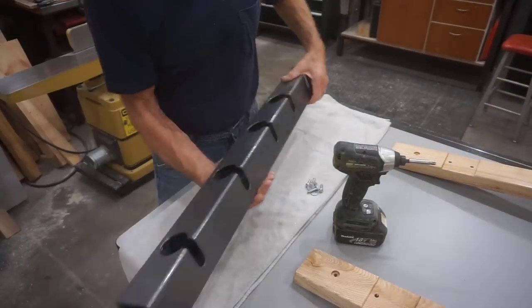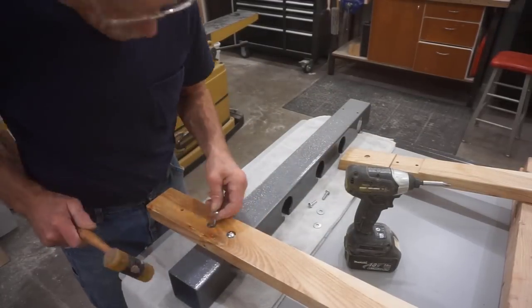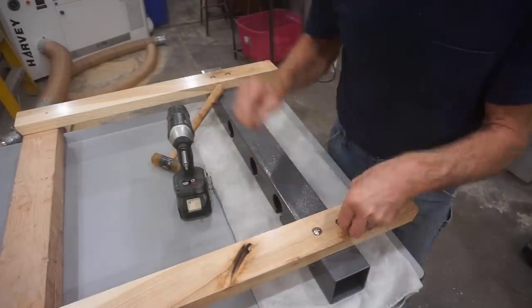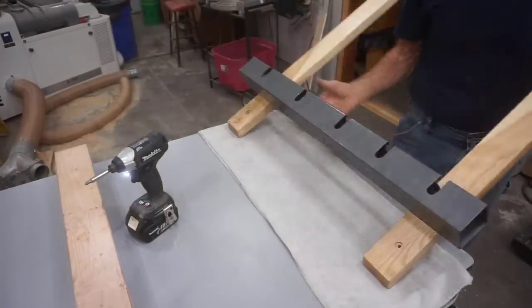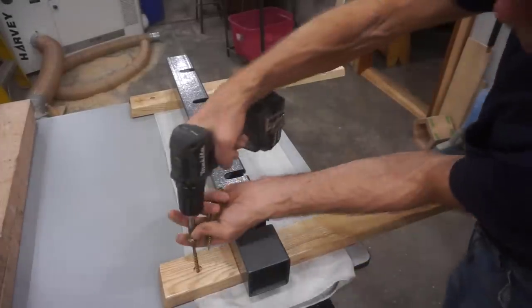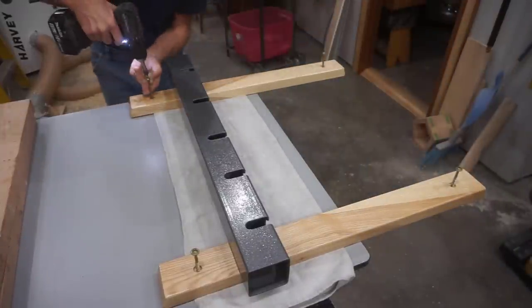Once all the pieces are dry, they're ready for assembly on a towel on my work table saw extension. I tap flat washers into the counterbores and then drive stubby quarter-20 thread Phillips panhead machine screws cut to length to hold the ash boards to the rack tube for a nice, clean, strong connection. You can see that even the machine screws are flush on the inside of the hanger tube. The final step for assembly is to pre-drive three and a half inch torx lags into each of the mounting holes so they're already in place when I wrestle the assembly to the ceiling for attachment.